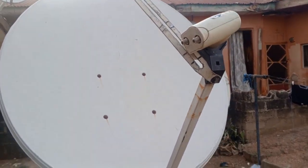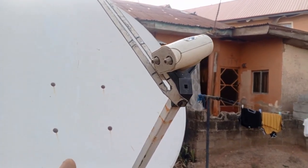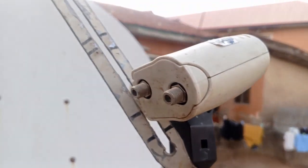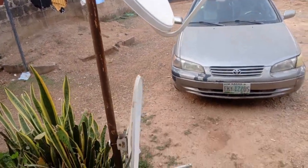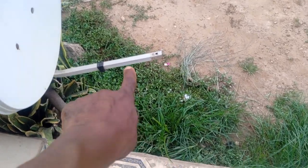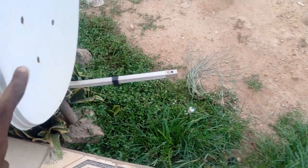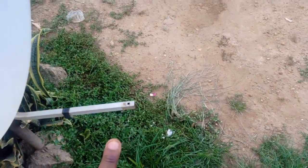Hello, wherever you are watching — this is Push Tech, continuing our satellite manoeuvring journey. I want to see how I can attach Intelsat 68.5E to this existing 36E setup. This 36E on a single dish is facing down, while the other faces up. The higher the degree, the lower the elevation on a single dish — 36E has a lower degree and higher elevation, while 68.5E has a higher degree and lower elevation.